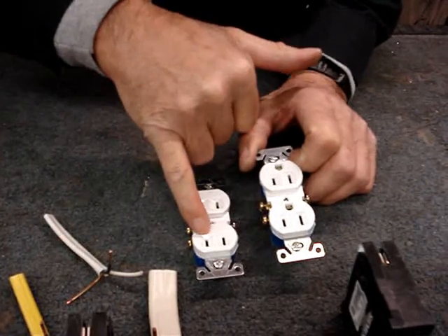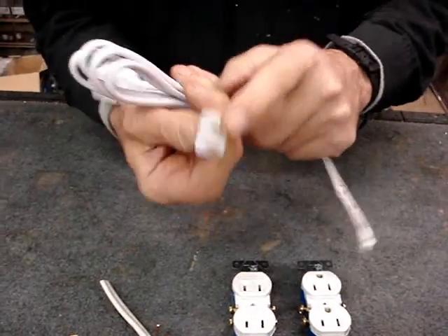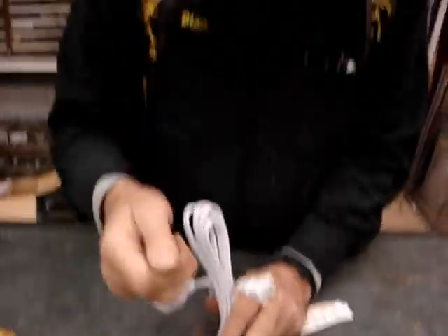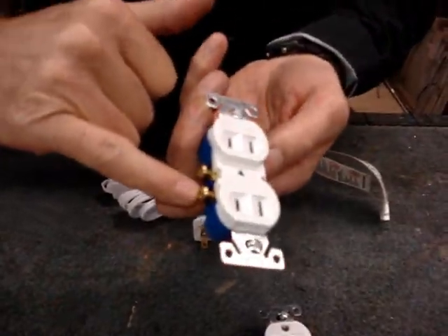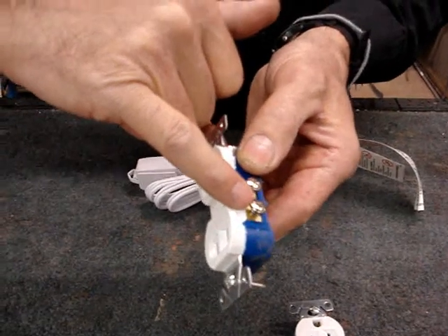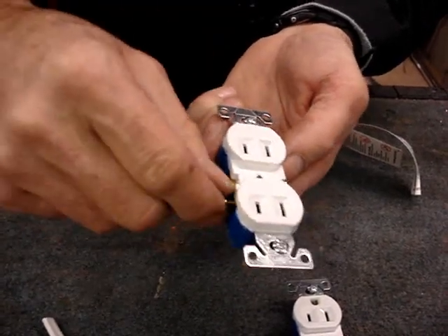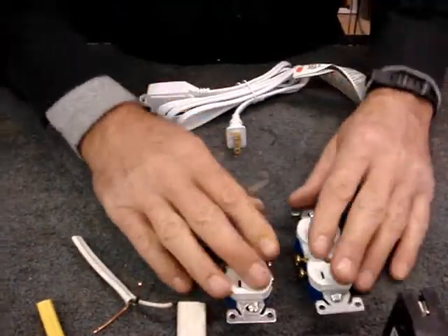Another thing about outlets is they're polarized. There's a little slot and a larger slot. A lot of your extension cords have a small prong and a wide prong. This is for child safety. Because what happens is when your child is in there with a paper clip out of your line of sight and they put the paper clip in the receptacle — the small hole is the black wire, known as the hot wire. The larger slot goes to the white wire, which is the safer or neutral wire — less chance of getting a shock. This wire is typically equal with ground, which you're standing on. The black wire is 115 volts different from ground. So if you grab the black wire and you're grounded, you're going to get a shock. If you grab the white wire, typically you're not. I don't recommend you playing that game, but that's what goes on.